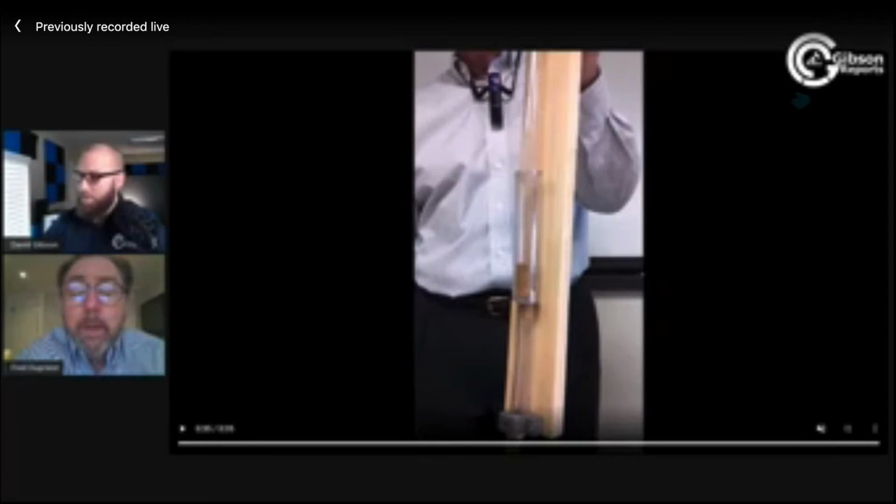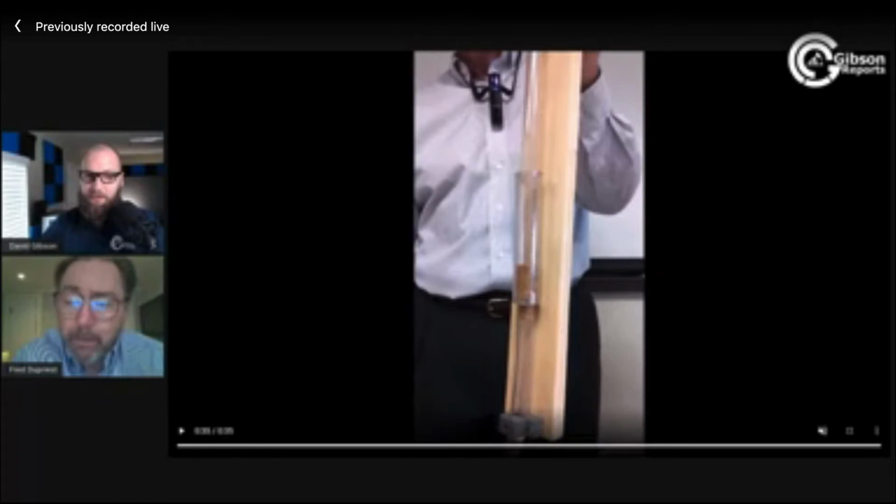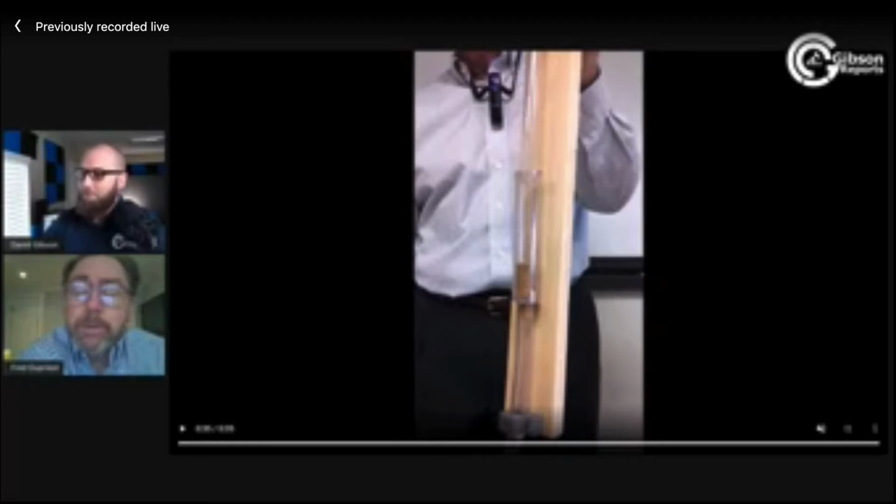So now what your diagnostics would be, that you have not a hole cleaning problem, but a hole enlargement problem, is that when you bring your pumps back on, you'll see extra pressure required to get started. But it'll free up. You're pushing on the bottom. Unless you pressure energize and wedge lock these things against the borehole wall, they don't have any strength. You're just going to fluff them and lift them and go back to drilling. So you might see a little pressure on connections. You might see a little drag.